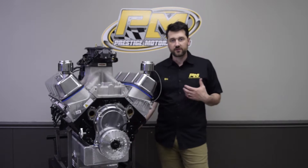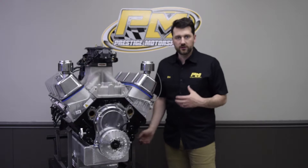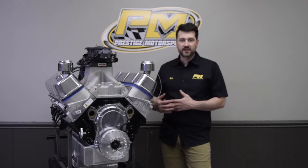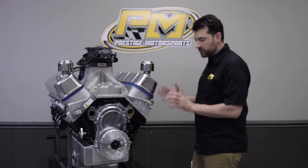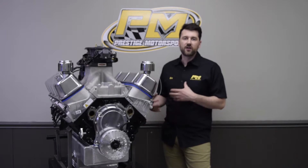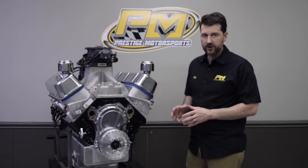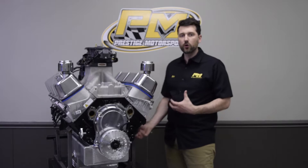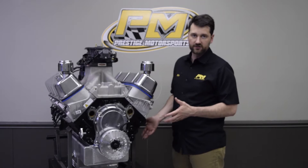Underneath, we have a Steffs oil pan. We've done a few changes over the course of a year or so developing and making these pans better. We've worked hand-in-hand with Steffs to add kickouts and baffling to make sure that in the airboat industry, as you're using these engines across the RPM range and in conditions on the water and in the swamps, you're not losing oil pressure. Oil capacity is a big thing in an airboat engine — these engines work very hard and gain a lot of oil temperature, so having a lot of oil pan capacity is another important issue that we've strived to achieve with these Steffs custom fabricated oil pans.